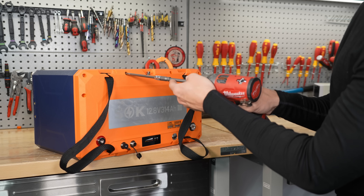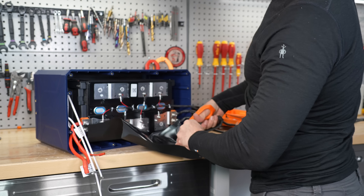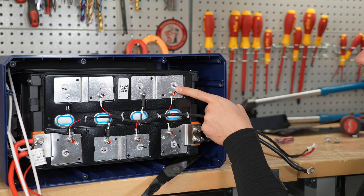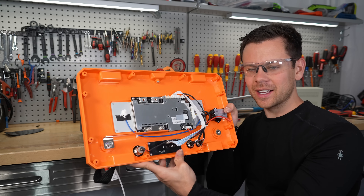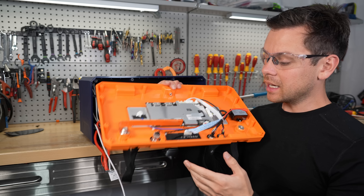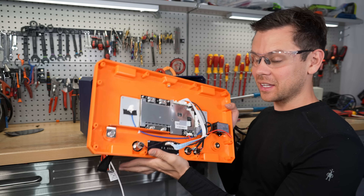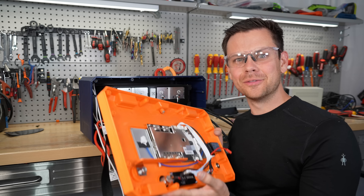Same size screws as the Epic. Opening it up — it looks like a SOK battery inside. A little bit of an improvement from the old SOKs but very similar design still. The cell holders and everything else looks just like the older ones, but the older batteries had screw terminals and these ones are welded. There are heater pads on both sides of the packs, and this one has two temperature sensors where the older ones would have only one. Comparing this to an Epic battery — this is simple but it works. It has a fire extinguisher, which is unnecessary for lithium iron phosphate but they add it for code compliance. Because this is a marine grade battery it's waterproof, so all of these things are potted or epoxied into place. The Epic battery on the inside is much fancier than this, but this one just works. These companies really need to fix their apps — how do you not have that done before the product is released?